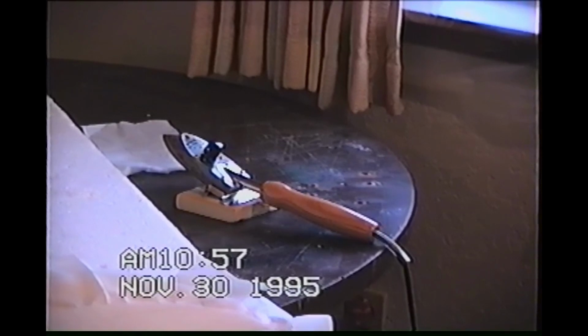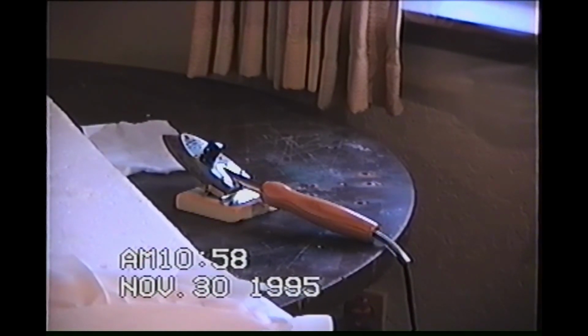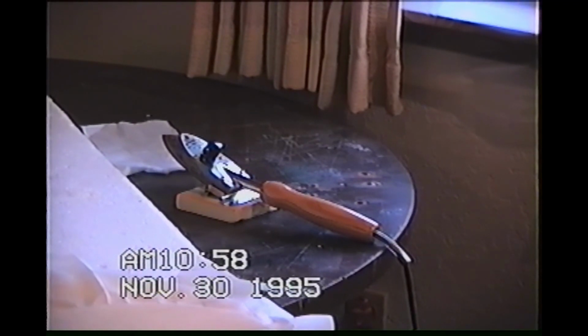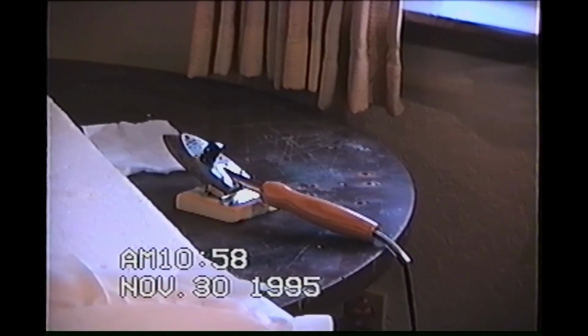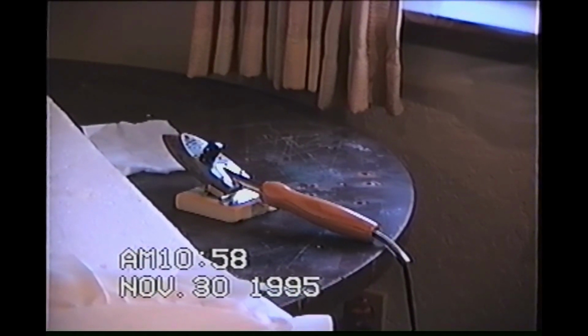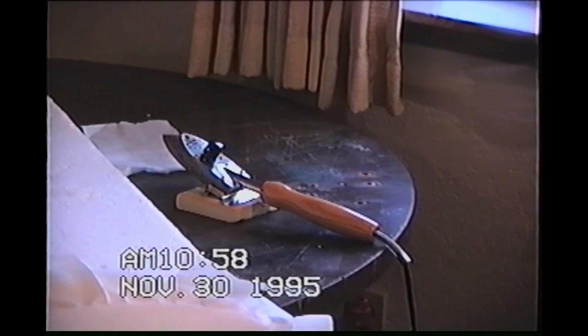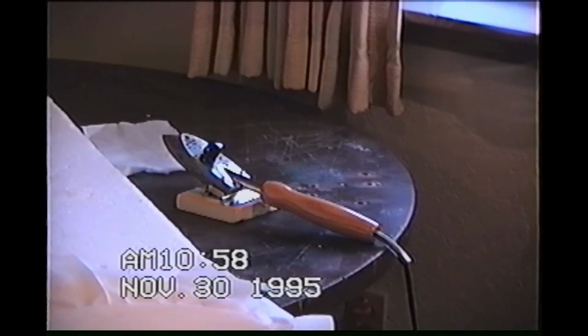And to clean it, like when I was using the green monocoat, some of the green would come off onto the iron, and then you end up getting messy and start transferring it. Keep track of your iron. You can get socks for them, like the see-through transparent ones, to prevent scratching on the material, so it doesn't look all scuffed up after you're done dragging the iron all over it. So you can get socks.